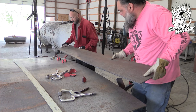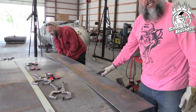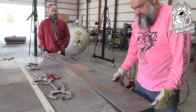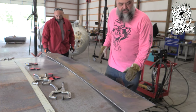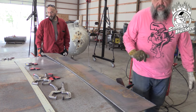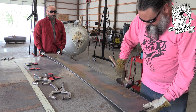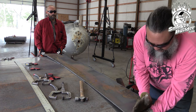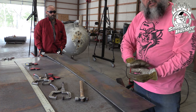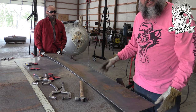The cut strip is laid out on top. You can see all the dross left behind from the plasma cut. Sometimes you don't have to grind it off — a hammer will knock it free. This dross should come off pretty easily, and flipping the piece over lets the grinding wheel catch the bottom edge and sling it off as well.